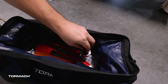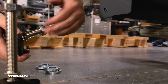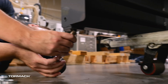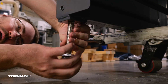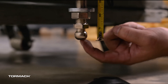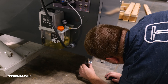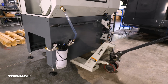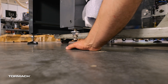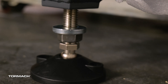It would be good to also store all of the shipping brackets in the tool bag provided. Find the lathe legs and feet. Turn the nuts almost all the way down and place the washer on top. If your jack doesn't go high enough, you may have to remove the feet by popping them out of the socket. Thread all four legs into their locations and place the feet underneath. Thread the legs up into the mounts so that they are roughly three inches from the bottom of the mount to the bottom of the socket. Place the pads directly underneath and start lowering the lathe. Once you get close to the pads, realign them to the ball sockets. Lower the leg until they're partly in the pad hole.